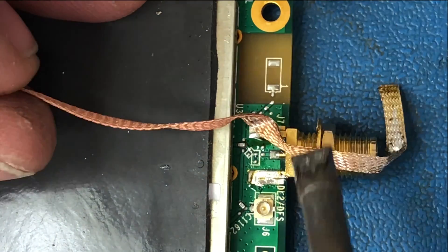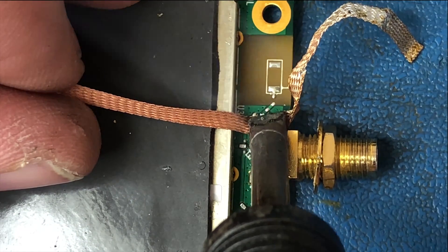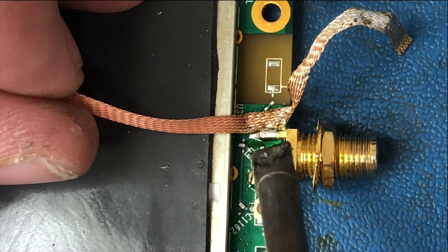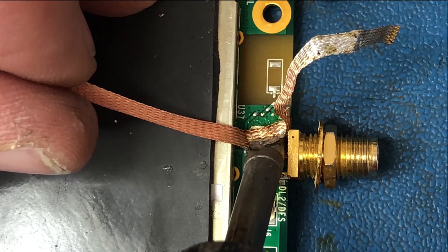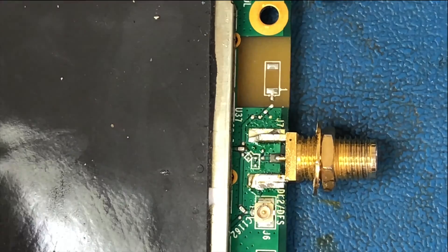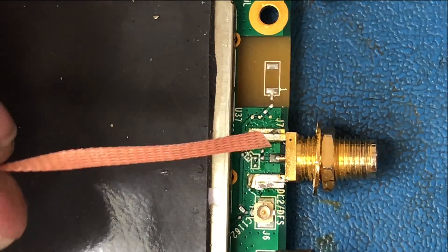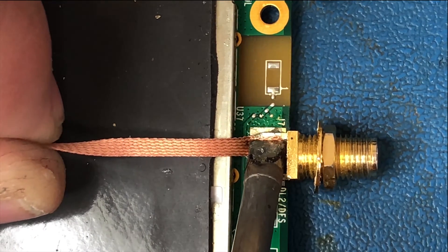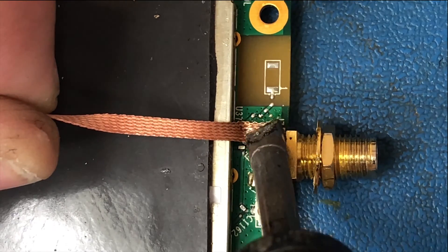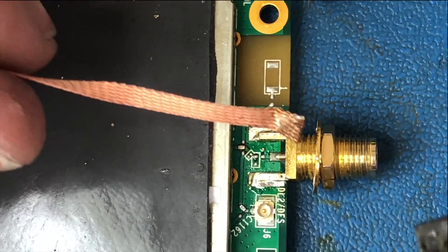As you can see I'm just using the wick working along with it. That tip in this iron is a standard 700-degree tip in the old Metcal soldering station that I use. It works pretty good, but it's also a very broad tip — this is a good tip for these legs that you see here.